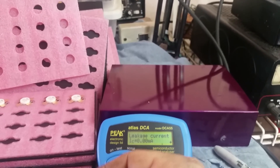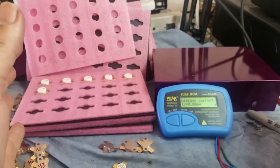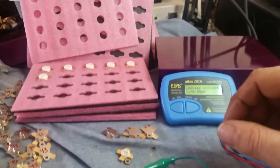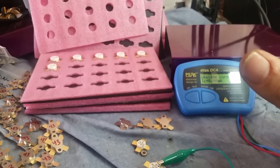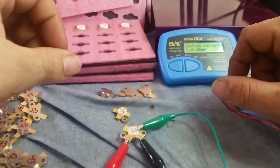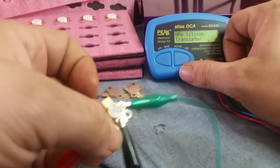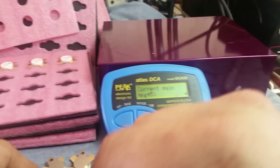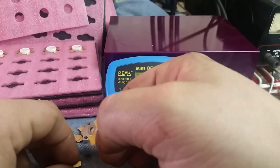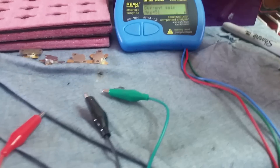The highest HFE value Motorola you'll see is a double orange dot. The HFE range is done by color. Let's see how close they are — we get 51. That Motorola would be considered within the proper range of the blue dot. If you look at the chart for the blue, which you can find in old data sheets, both are within that range. The double orange cuts in much higher figures.